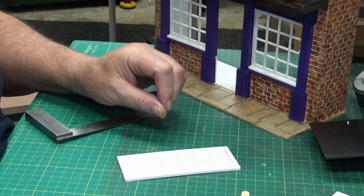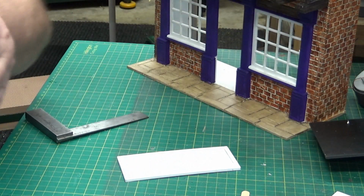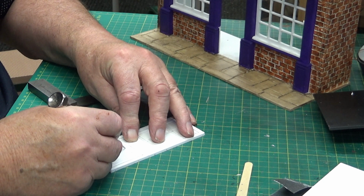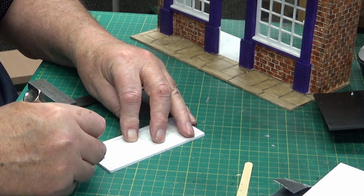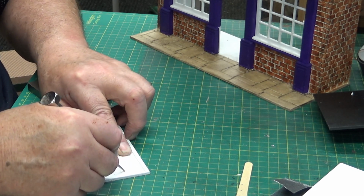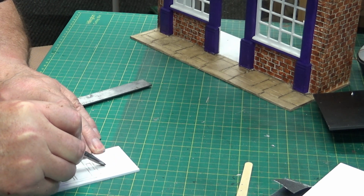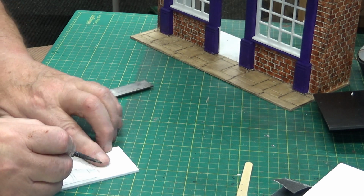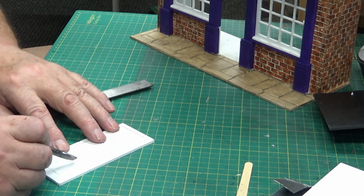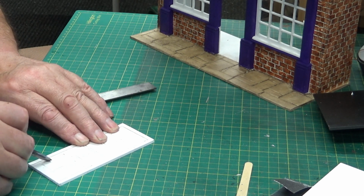So what I'll do now is I'll show you this little trick we do. I'll use my little chisel, what I cut my bricks in with. What I do with these is your usual thing, go around again. Is that creating a bevelled edge? Yeah, this is what I'll do then, just show you how I would create a bevel edge. So you go from this one inwards, so it's pressing like so, and what you're doing is pushing the Foamex that way. So same with that one, then turn it round and push it the opposite way, so the panel's going inwards. So is that like maybe 45 degrees? Yeah, probably about 45.